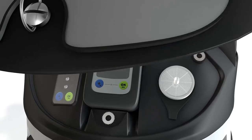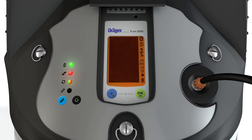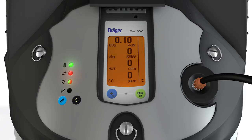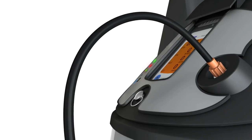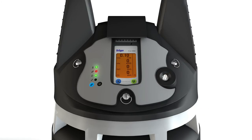To use the X-Zone's built-in pump, put the filter and the pump cover on. After power-up, the pump test starts. The pump LED lights red-green and emits a beep. Bend the probe hose at the end — this interrupts the pump flow and emits a continuous tone, and the LED lights red. Release the hose again; the tone changes and stops, the LED lights green, and the pump is running. If the pump test is not complete within 60 seconds or the system leaks, the X-Zone alarm sounds. Switch off the X-Zone and resolve the fault.